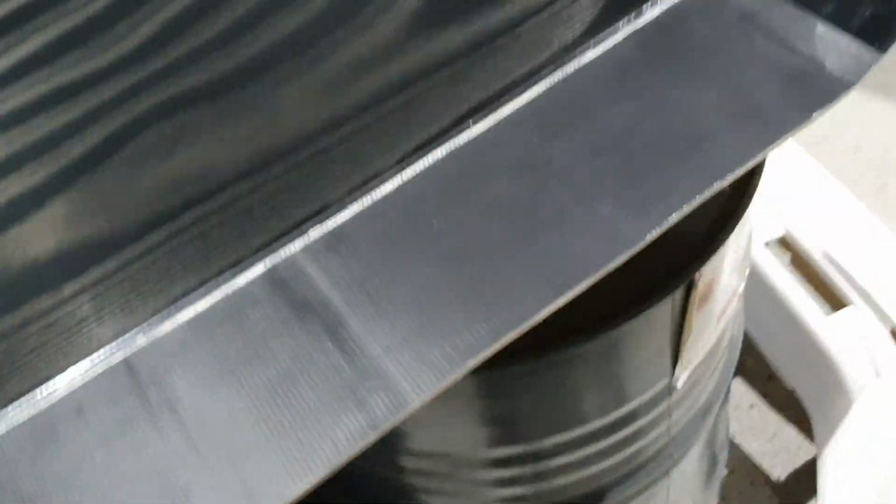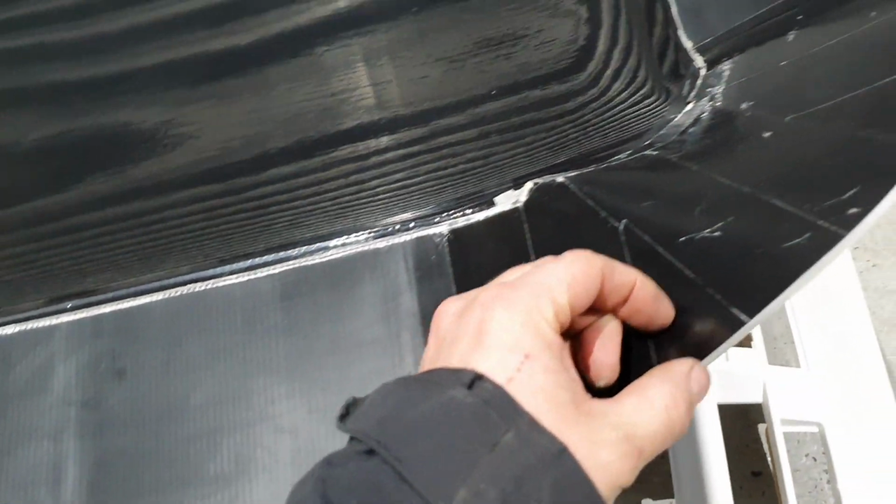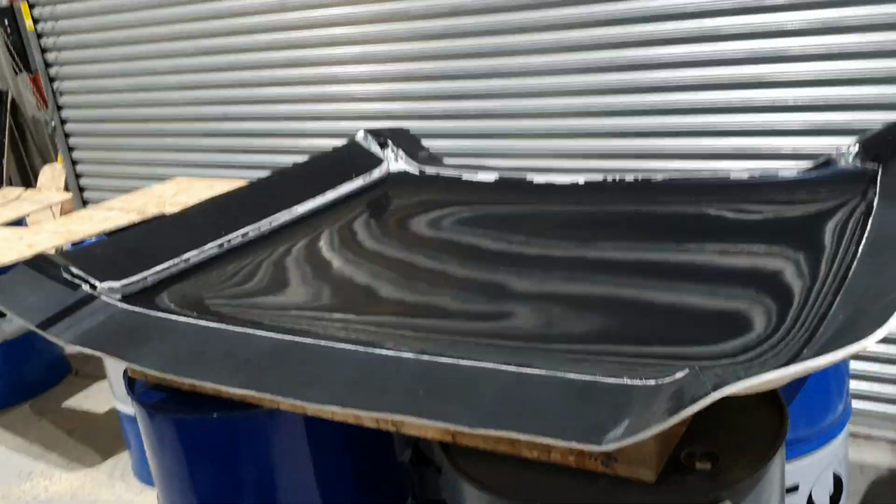So when we took a mould from it, all the paints are sprayed, and when they're sprayed on, it gives a slight, not orange peel, because the painter was very good who did it. You can see how good the reflection is in the gel coat, but there is slight peel to it. So we'll wet flat the whole item, and that'll give us a mirror finish of the actual roof skin part, and that will then be an absolute perfect skin once it is taken out of the mould. Obviously the flange area is always dull, so that we can stick our tack tape to that, and then the vac bag, and we'll be making roof skins in resin infusion very soon.